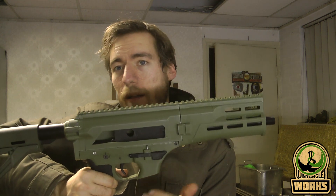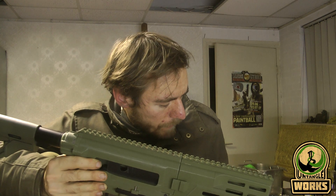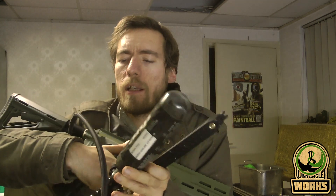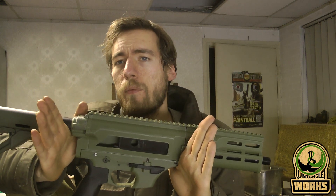I'm glad I just started trying a lot of things with the compressed air — different settings, different springs — and it got to the point where it started running, and then I could also use green gas. One tip for people interested in 3D-printed airsoft builds: it's really handy to have compressed air, because you can adjust the pressure very accurately. It's easy to see whether a spring works well at high or low pressures, since you need a real balance when you have a hammer spring. Finding the right combination of springs gives a really wide spectrum of adaptability — not just a narrow pressure range.